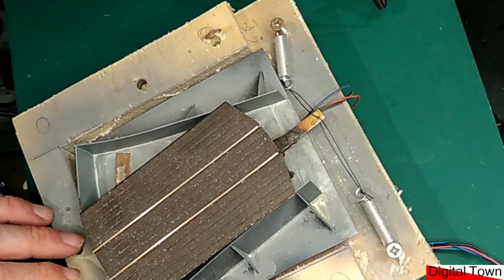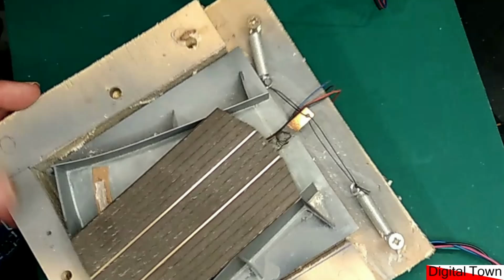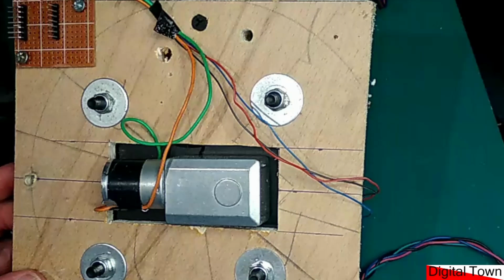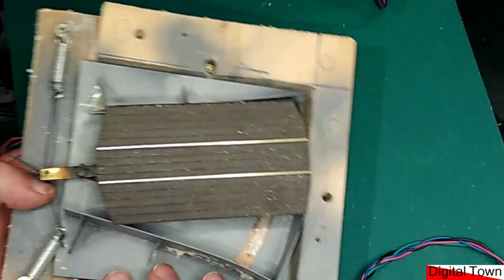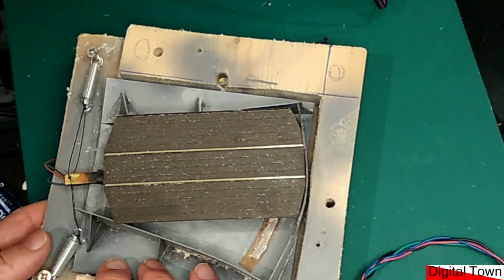And of course the danger was that if I tried to stop it, the torque on this thing... it's only a 12-volt motor on the back. It doesn't look very big, but when you've got a 100-to-1 reduction gear on there, suddenly the torque becomes extremely high. So as you're thinking about moving parts, even an electric motor on your desk with a fan blade on it, put your finger in the way of that, it is going to hurt.